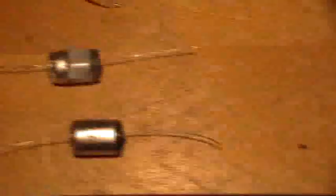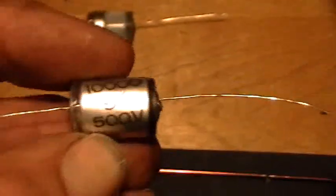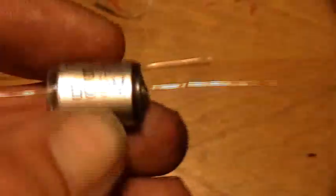I have a bunch of those just like that. The tolerance in the capacitance is 5% and 500 volts is the maximum voltage it can handle safely without puncturing. Here I've got one that I've sectioned on the bandsaw, hoping to show you how it's actually made.